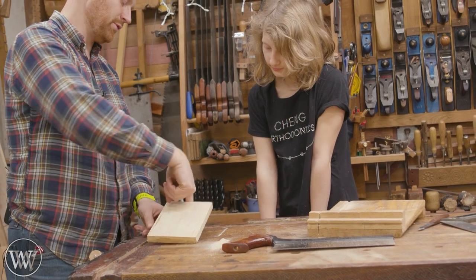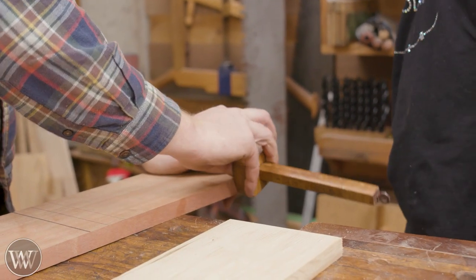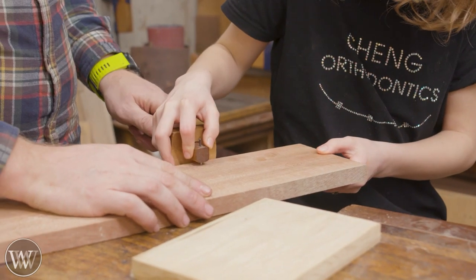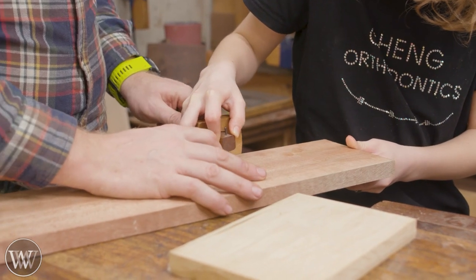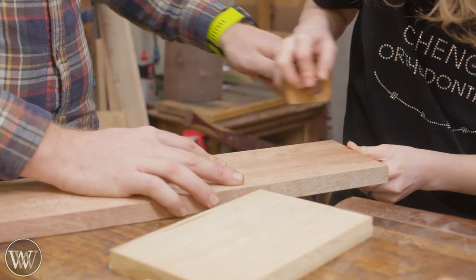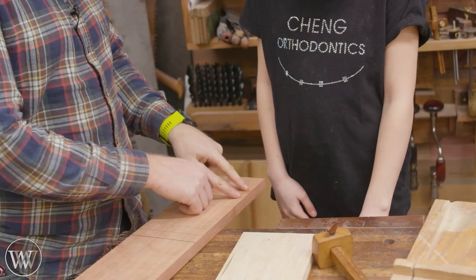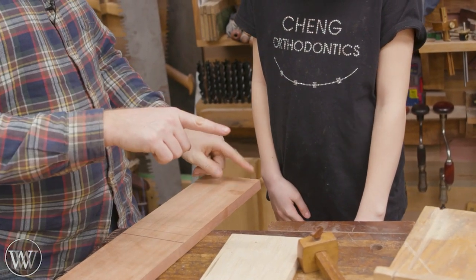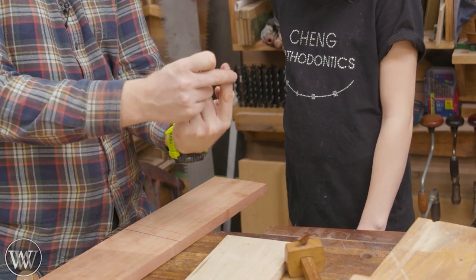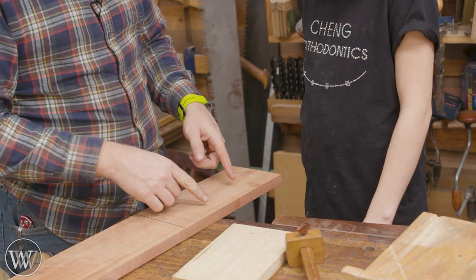The bench hook doesn't work as well for the wide boards, so a lot of the sawing is done in the vise. I like doing the vise, but letting her do as much as she wants — and if there's a section that's long and boring, I might do some of that myself just to keep her engaged. Now we're going to do the vertical post that needs to go through, cutting a three-quarter inch hole into the base for the three-quarter by three-quarter inch rod. The rod and arm are going to be made out of the Filipino mahogany, so we're going to use the marking gauge. This is a great skill to learn — being able to know where and how to hold it to get an accurate line. It sounds very simple, but until you wrap your brain around it and get that muscle memory, it's hard to do.